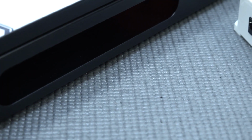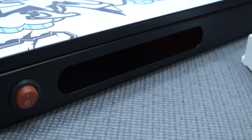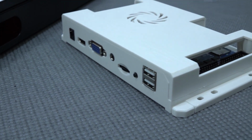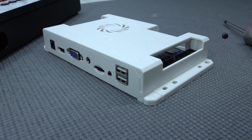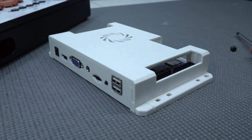So another thing that is super convenient is that this thing has this gigantic gap at the back. What do we mean by this gap? There's a lot of space to basically put a new Pandora box in here. So that is a positive thing about it. If you don't want to have this shitty board, you can upgrade it with something else. But take into consideration when you order one, you need to have one with a complete plastic case. Because they also sell boards with only the PCB, and that will not fit.